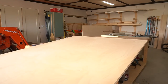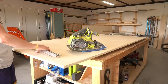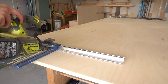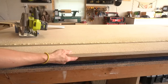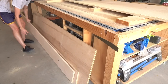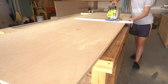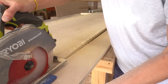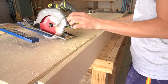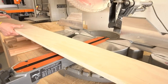Just like with all the other pieces in this series, I used maple plywood for the vast majority of this build. I started out by cutting down my plywood sheets. I used a circular saw and a Kreg rip cut to rip the first sheet down into two 9¼ inch strips that will become the side rails later. Then I adjusted my rip cut and ripped the remaining sheet into several 5 inch wide strips that will be used throughout the rest of the project. I have a plywood cut diagram with all the cut dimensions in the plans linked below.